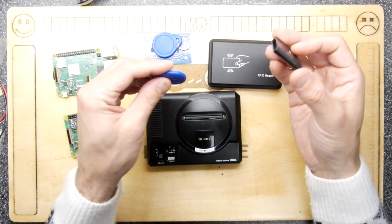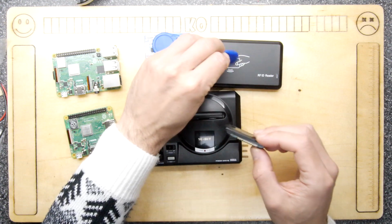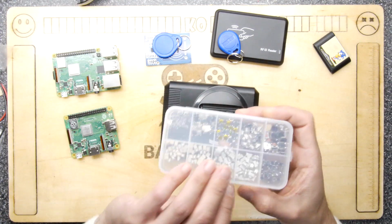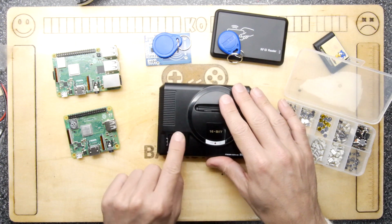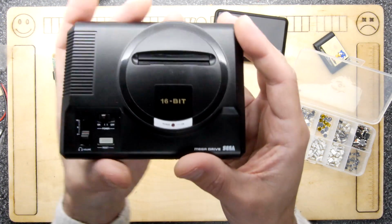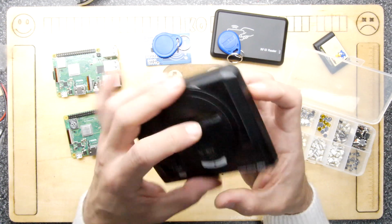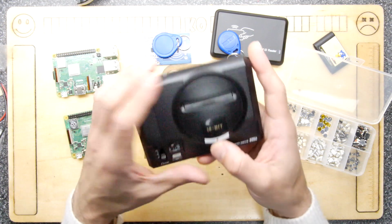Whether or not these are possible to use, I don't know, because you can imagine if they're in the cartridge they'll be mounted vertically, and I don't think the readers generally respond to vertical things. I do have a big selection of tack switches, so it may be possible to tack up some of these, so we'll have to work out that approach. And because this LED is so tiny, we might have to drill that out and make our own fake LED, or at least a channel to a real LED, out of a bit of fibre optic or something like that.